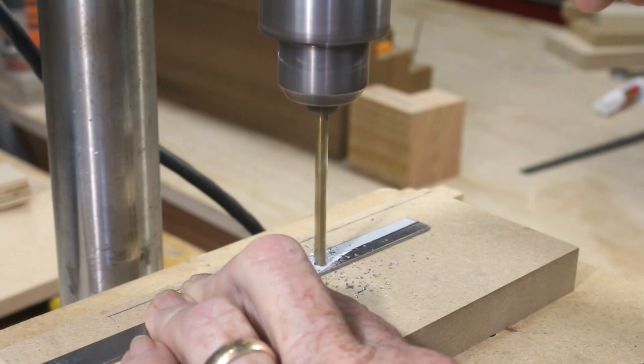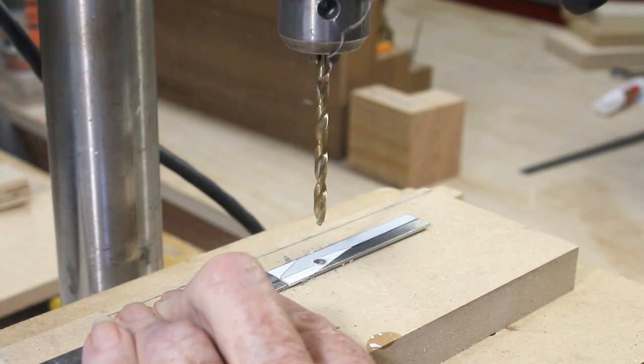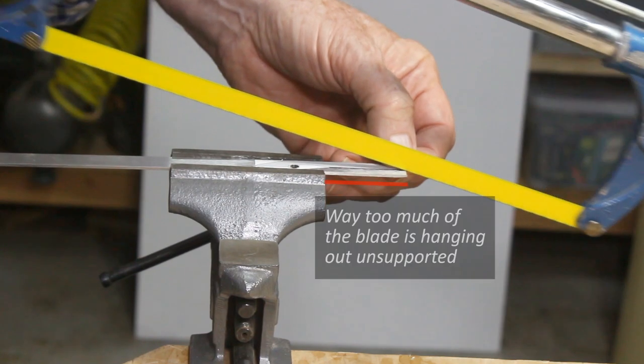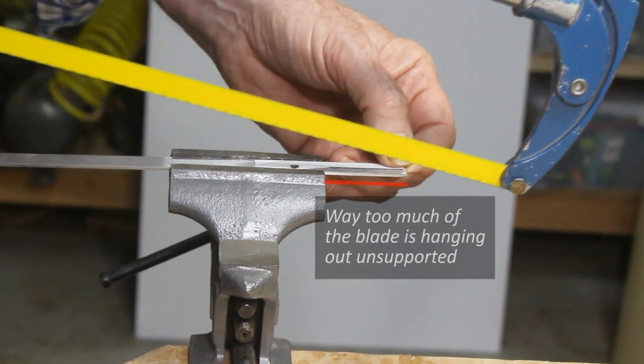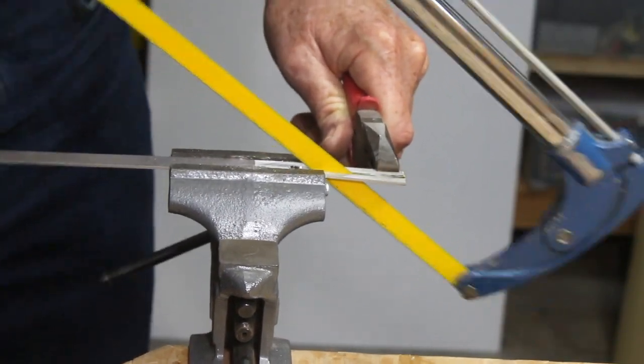Alternatively, you can just cut straight lines and then form the curves with a round file. This steel arrives annealed to its softest condition, so it cuts quickly and easily with a hacksaw or files. Hand tools are a good choice for these very small blades. You're not removing very much steel.